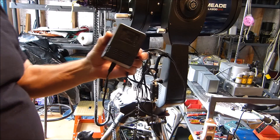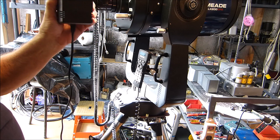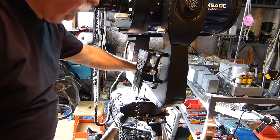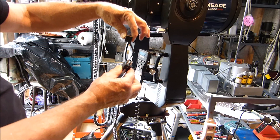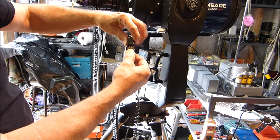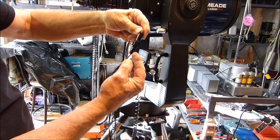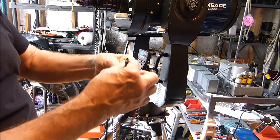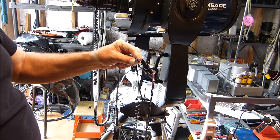When I plug this into a wall outlet here at the house, it works great. But I'm going to show you what I use out in the field. I plug that in, then I have a plug right here so in case I stumble over it, I'll unplug it instead of ripping the wires in two. It's polarized. Then I have a fuse right here in the middle. We're going to take the fuse out in a minute — that's the way we're going to measure the current. First we're going to plug it in and measure the open circuit voltage.